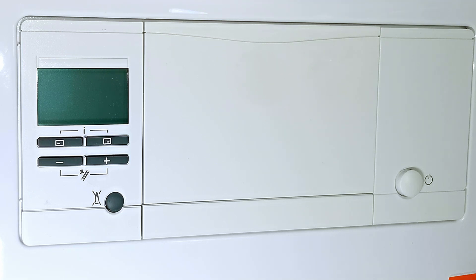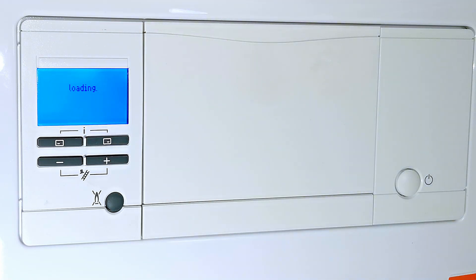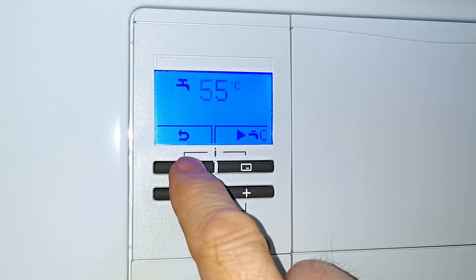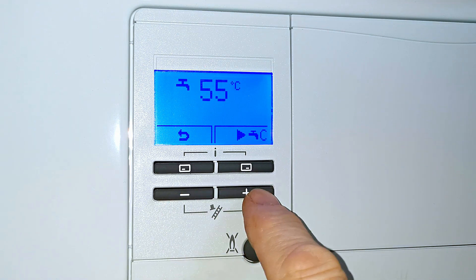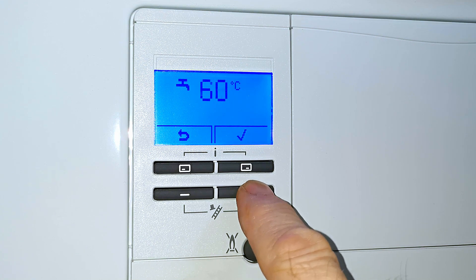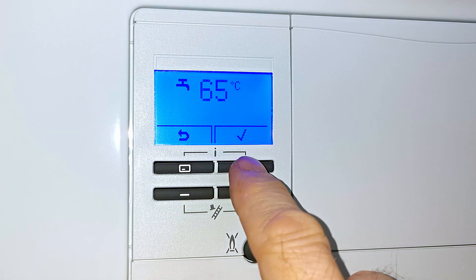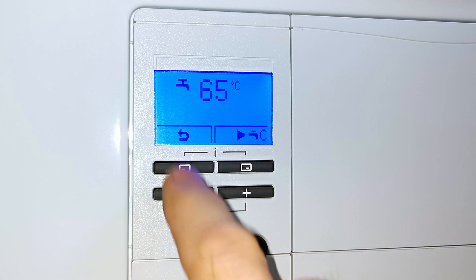When the display is off, the boiler is off and you can't get hot water or central heating. Press the button again and power comes back on — the screen says 'loading' and you'll hear the boiler go through a little start-up process. Make sure all your hot taps are turned off when the boiler is starting up. To adjust the hot water temperature, push the button directly underneath the hot water tap symbol. On this boiler the water temperature is set at 55 degrees. Press the plus or minus buttons to adjust it, and you can take it up to 65 degrees. Once set, press the tick to confirm, then the back arrow to return to the normal display.